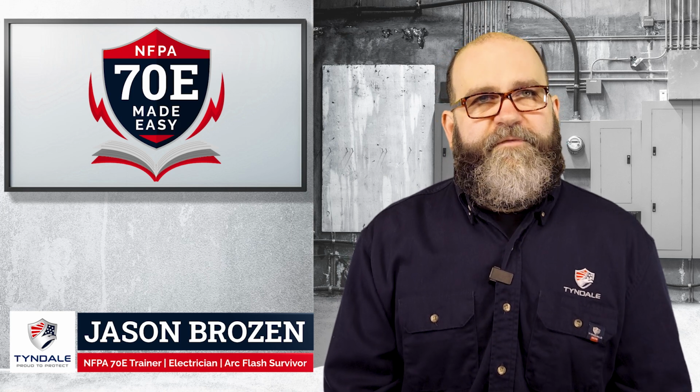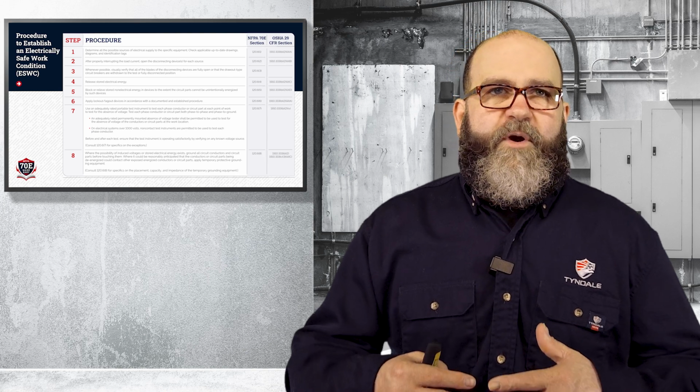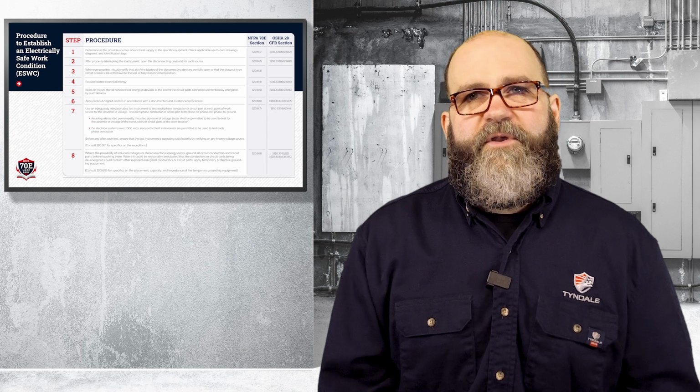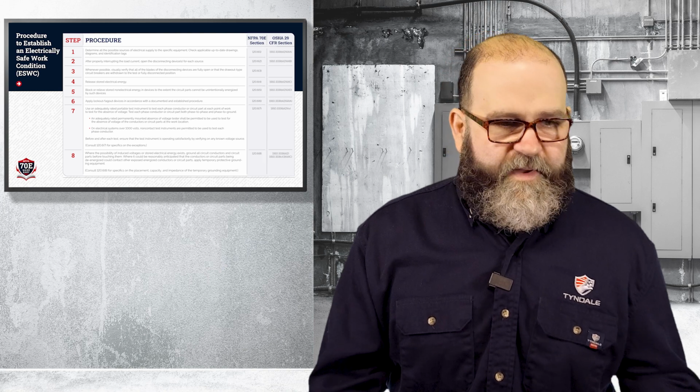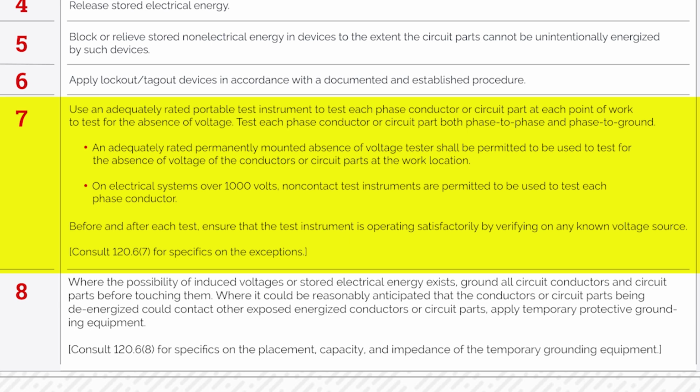Today is my bunny trail video of 120.6, step number 7, where I talk about that adequately rated phrase in there. So I'm going to read this really quick so we can look back and review. Step number 7 says to use an adequately rated portable test instrument to test each phase conductor or circuit part at each point of work to test for the absence of voltage.